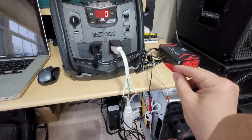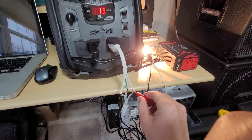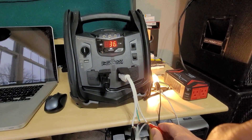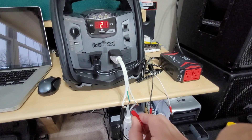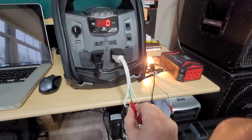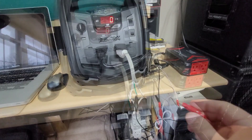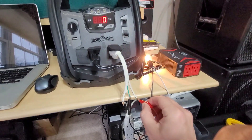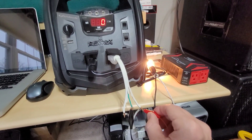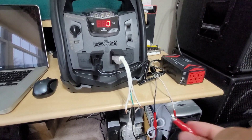So here we have a 40-watt incandescent bulb connected to neutral. We have 123 volts coming out between hot and neutral, which the bulb is going to light up all the way — it's about 36 watts. However, the live neutral means that the neutral in respect to the earth ground has half of the line voltage, so you see the light lights up more dimly. And as you can see here between earth ground and hot, the light turns on dimly as well. You do not want to short your neutral and ground wires on a modified sine wave.